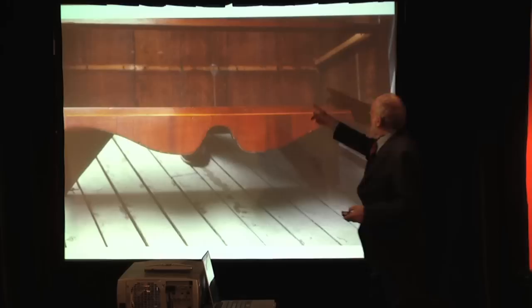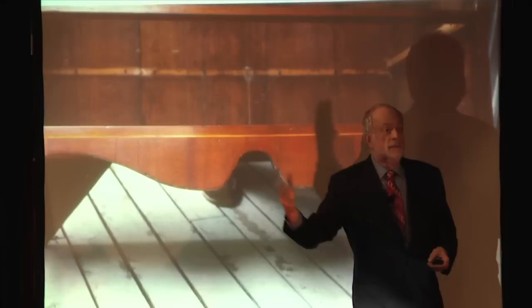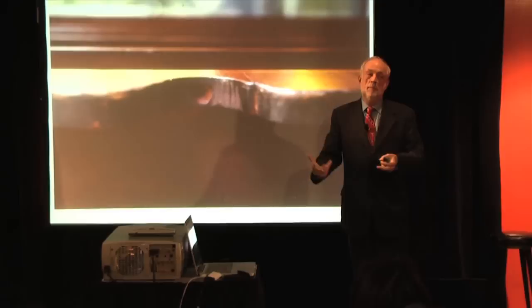The back, with nail holes to nowhere and scarring, was off something that had shelves — that's where a shelf was. You don't need shelves inside a chest of drawers. Those drawers had been borrowed from something else; the backs had been whacked off and the piece made shallower. It's all worked over. This was very typical of what went on in the American furniture industry in the 1910s, 20s, and 30s — taking pieces and making better pieces, improving pieces. Not just the English did it; the Americans did it also.